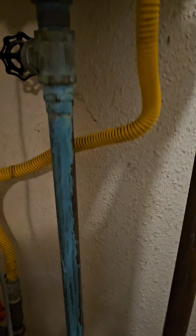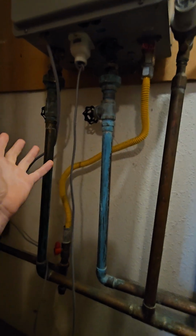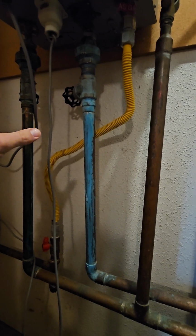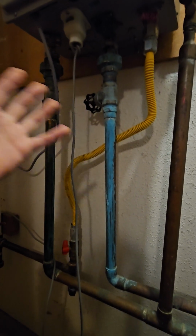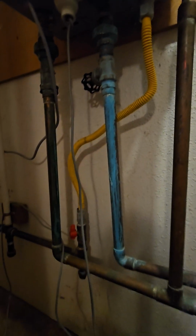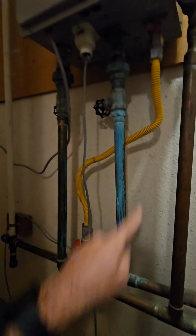The other thing we're going to do is install a boiler manifold valve right here, and we can build that in the field. It will have a pump inside of it, or we can just get one from Navien or whichever brand we end up using here, and it's pre-made, so sometimes that's nice. And that's going to be a primary loop, closely spaced tees, and then we're going to rebuild the floor loop.